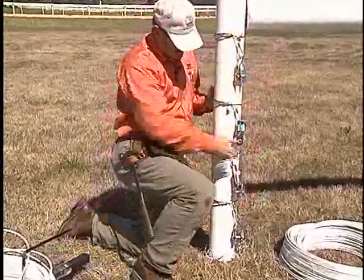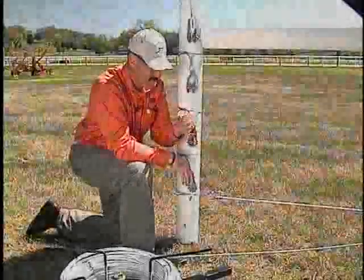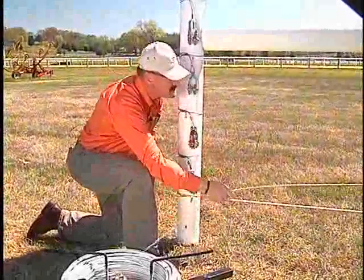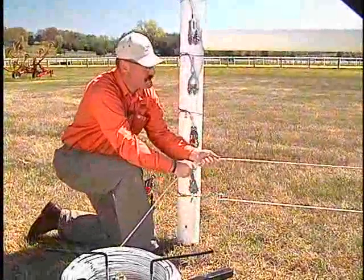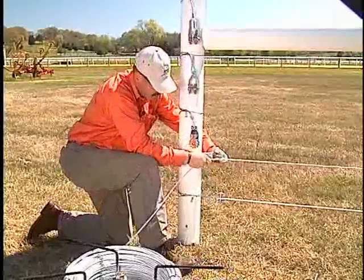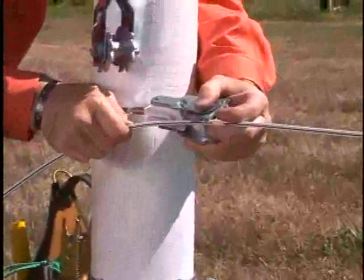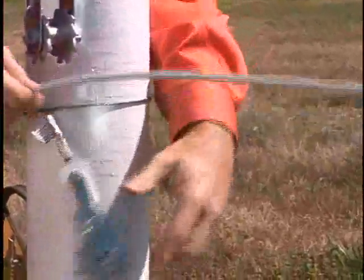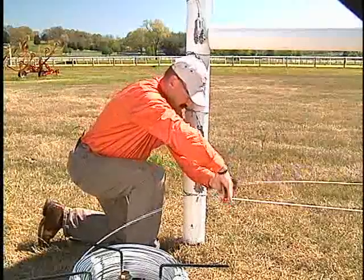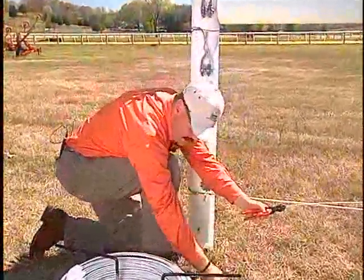We're ready to tie them off, pull them to the opposite end, come back here, remove all the slack, and tension them up. Now that we've anchored our individual strands off at the opposite end, what we want to do is remove as much slack as possible as you come back up along the line. To get it into the tensioner itself, you just want to pull it up, kind of hold your tensioner out, and come just about to the back side of it — about four to five inches past the drum itself. Take your wire cutters and cut that off, keeping that from going back on you.